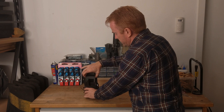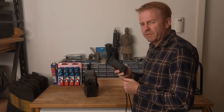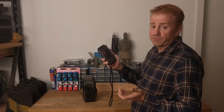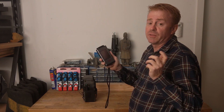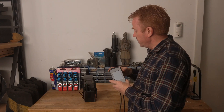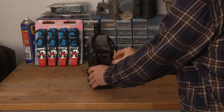One of the tools I keep in this pouch is my color spectrometer. My toolkit is worth about three and a half thousand dollars, and this device is about two thousand dollars of that. If we're working in a shopping center, I can take a reading off the ambient lights, and it will tell me all the information I need to match my other lights to them.